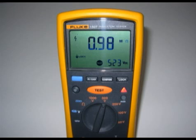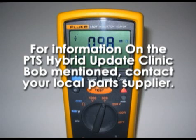It is important to leave the test leads attached to the component being tested until the test has been terminated, as the high voltage will then be dissipated through the component and not through you. If anybody has any other questions or concerns about this unit, what it can do, or maybe you'd like me to do something with it and see the results, by all means get in touch and I'll be happy to do it. Have a good day. Bye.